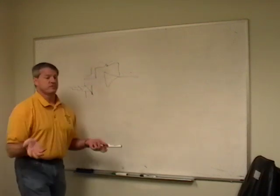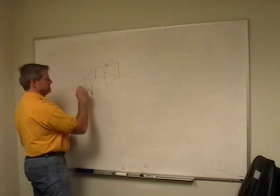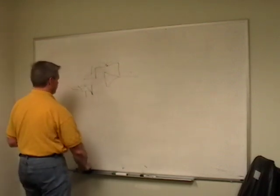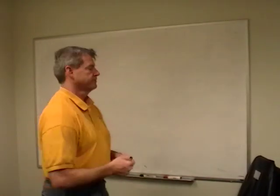This is how CMOS chips work, CMOS imagers work. They basically put little photodiodes in there. They just have diodes and light hits it and then they amplify the output. There's a lot more to it than that. I'm simplifying. But the first stage of doing all this was something called a CCD, a charge coupled device.